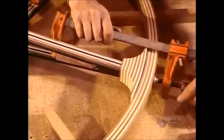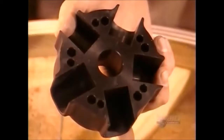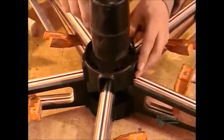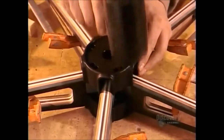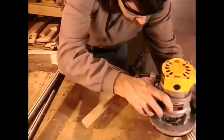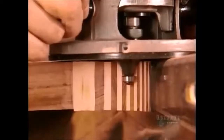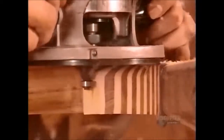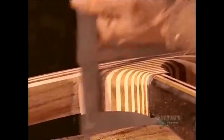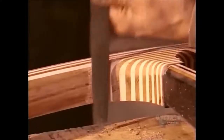Through the openings, he clamps the spokes to the rim, then positions an aluminum hub in the center, tapping it into place with a mallet. With a jigsaw, he cuts a sliver off the ends of the fairings so they'll curve into the rim. He uses a router to round off the vertical edges of the wheel, then files the fairings by hand to complete the smooth transition to the rim. Just these finishing touches alone can take up to five hours to complete.